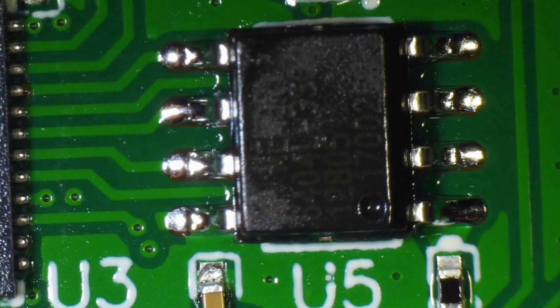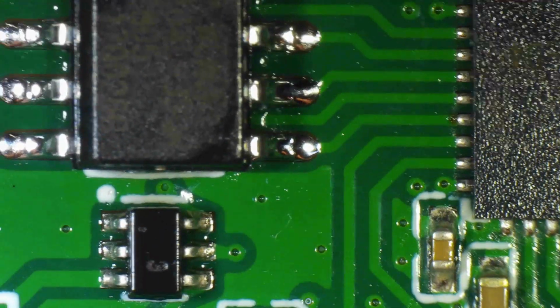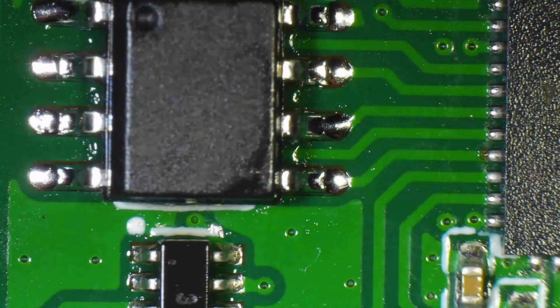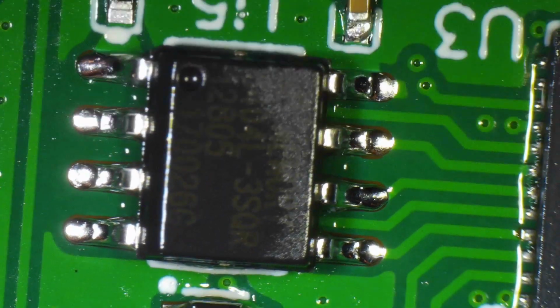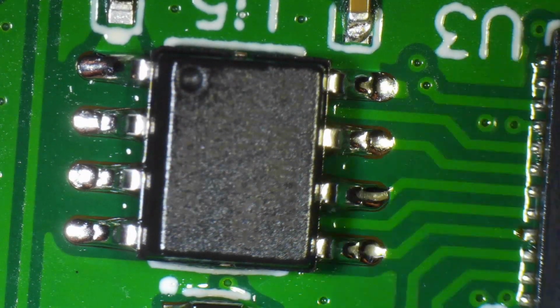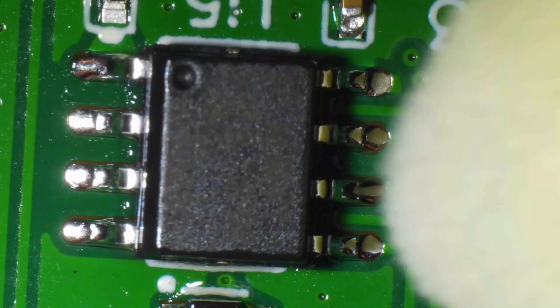So this is the final inspection. This is the easiest of the chips to solder. Too bad I lost the footage, but yeah, there's not much lost here because it's the easiest of them all. This is just the final inspection to make sure that all the joints are okay, because I don't want to be thrown into a wild goose chase when I turn this computer on, just because one of the solder joints is actually not made, there isn't enough solder, the contact is not made, even though visually it looks like it is, and God knows when I will find that kind of problem.